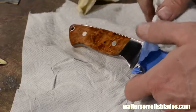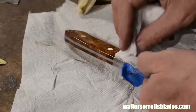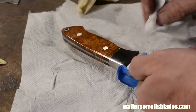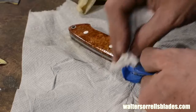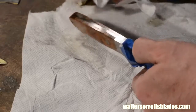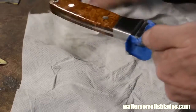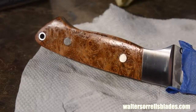So, I spend a couple of days laying on a little tung oil, letting it sit, then rubbing it off. This slowly builds up a thin layer of oil, which will not be hard and reflective and shiny looking, but it will give some depth to the burl and give a nice warm glow to the wood. There's really no rule about when to quit. Eventually, I'll just lose patience and stop. It's amazing how many important decisions in my life seem to be made that way.